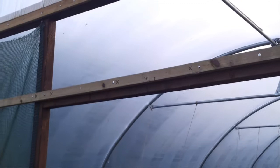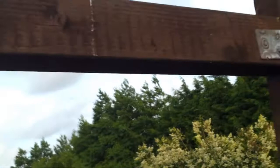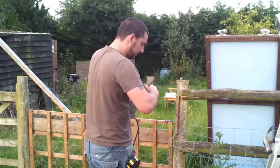Just a quick thought as we're putting in where we're going to drill the bolt holes for this. If you can see, we were originally going to put them on the end here and crossed that out, because on the opposite sides of these we've got loads of nails and a mess of nail plate, so that's not going to work. So we're going to have to go in about 6 inches on either side. It will make the mounting holes a little bit closer together, but to be honest it's not going to have a huge amount of weight on it. It sticks out anyway, and we've got plenty of room for the bolts to go through. So Heimdall's going to go and drill these now, and we'll be back for that.